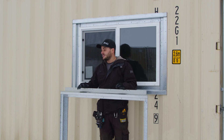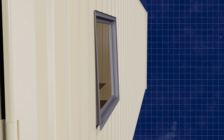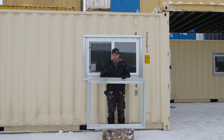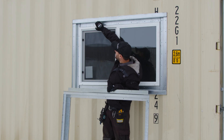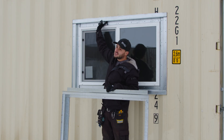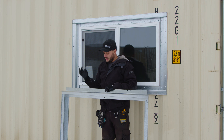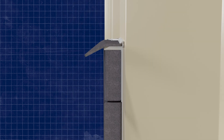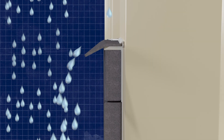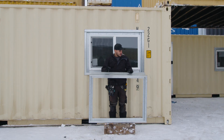With these framing kits, they're designed so that you assemble them yourselves. Typically there'd be four pieces to the frame, but in this new design they've taken the rain drip profile, similar to the Mandors, and included it in their windows now. This is a huge improvement because prior to this, water would come down the corrugations around the header and back, and we always had to seal it up very well with sealants. Now that problem is solved — water comes down onto the rain drip, there's an angled profile, and it drips in front of the window rather than coming back around to where the flange sandwiches the nailing fin of the vinyl window.